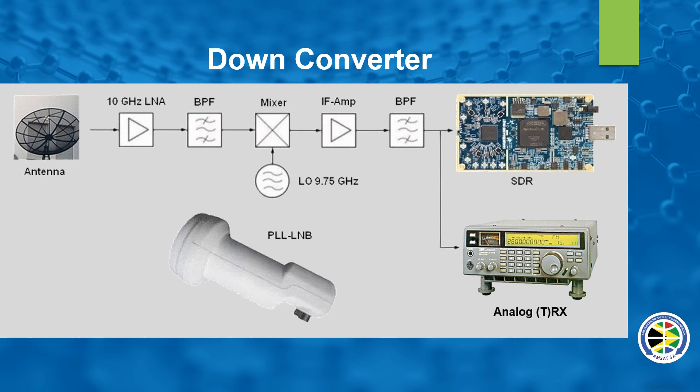The output of this setup you can take either to an analog receiver like the ICOM 9500, or you could go through an SDR, plug it into your computer, and you are watching your satellite. It's actually very easy. Just make sure you've got your bias tee on and the right frequencies. Use some nice software on your phone to locate where the satellite should be, make sure there's not a branch in the way, and once you've got a clear view to the satellite, you're cooking.